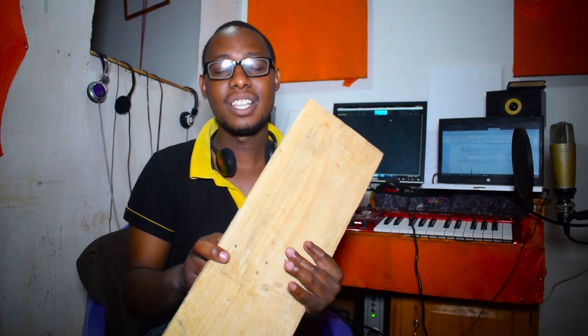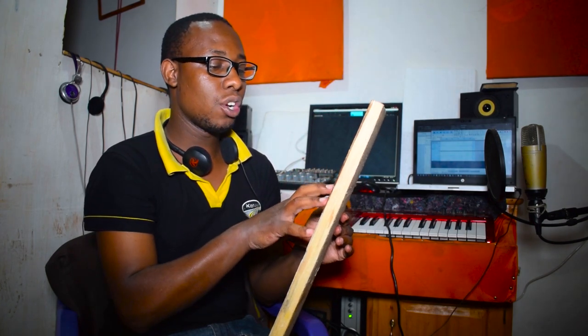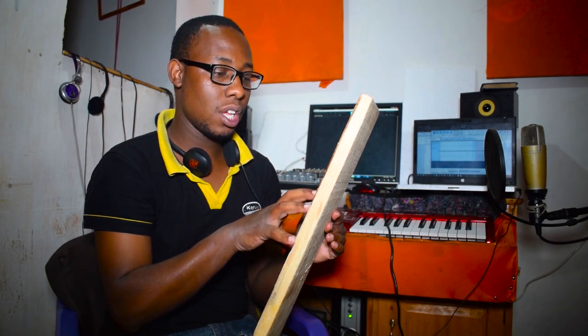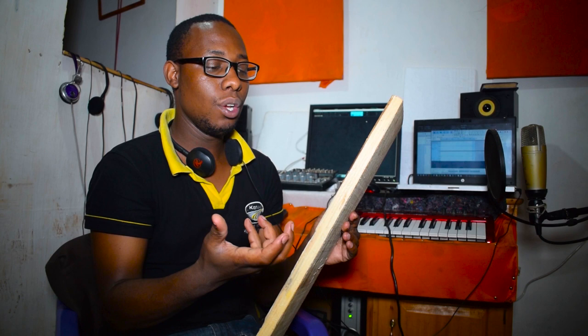So here is the simple demo of the experiment. We are going to record the taptones. Taptones are sounds made when you tap the wood. So we record this, we feed it in an algorithm, we extract features, and we train the algorithm. And then we make a prediction and see whether you can predict 16% moisture content.